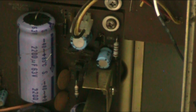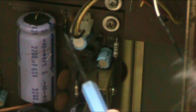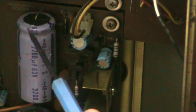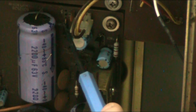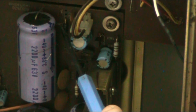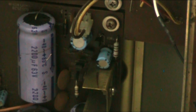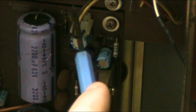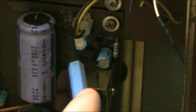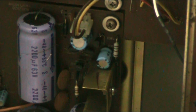Makes no difference, because what the problem was, we were getting this Zener here was blown, was short circuit, so I replaced it, and I was still getting nothing. It was lighting up, and the power amp was driving. That was all going because it runs on a separate supply. And basically, there was 30 volts missing from this brown wire here. This brown wire has 31 volts on it, sorry.